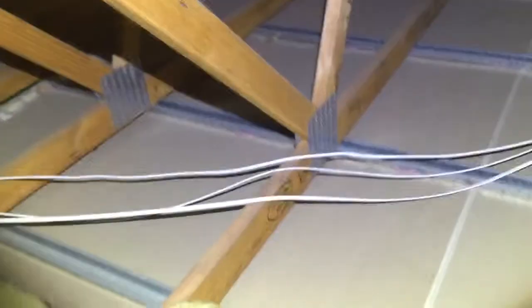It's certainly a good thing to have. What I'm showing you here — you've got some back blocking missing here. This is the plasterboard; it's outside your patio area and you've got quite a big expanse here. You'll notice underneath I've commented about it in the exterior item — there are discolorations where the joins are. These are the joints where the plasterboard sheets meet, there's one just here that goes up like that and then goes over like that.